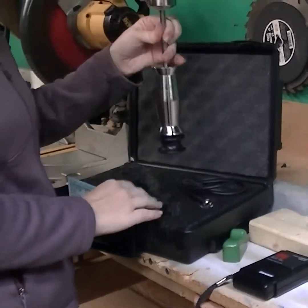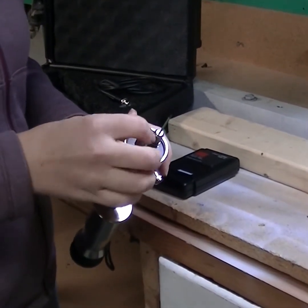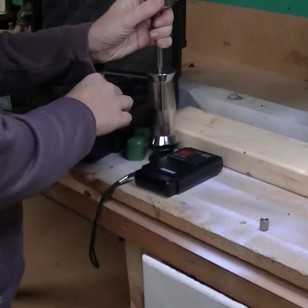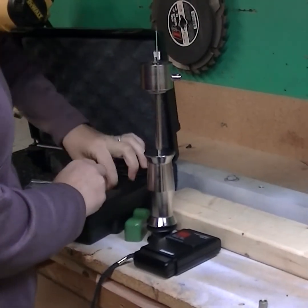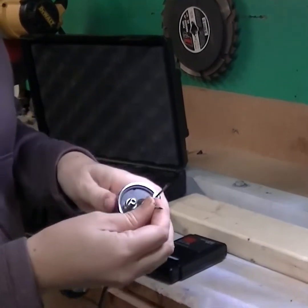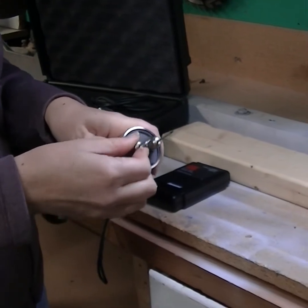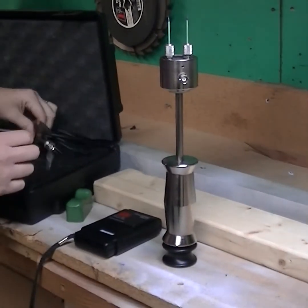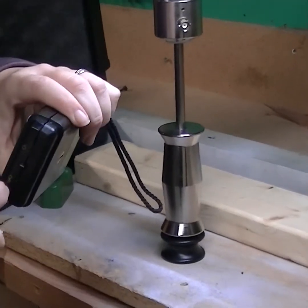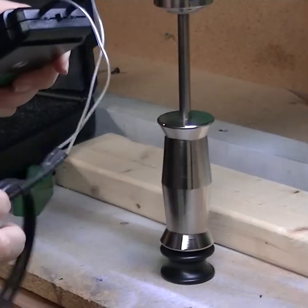Next we will demonstrate how to take in-depth readings using the E12 slide hammer. You begin by installing the pins. Today we will be using DA inch-and-a-half pins. Simply unscrew the cap nut, thread the pin through the hole which includes a small rubber gasket, then replace the cap nut onto the top of the E12. The BNC mini cable connects the E12 to the DXC. The end with a small gold plug slides into the connector on top of the DXC, and the other end of the cable connects onto the E12.